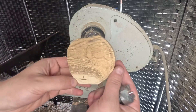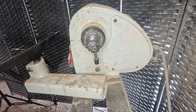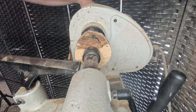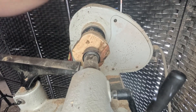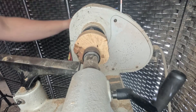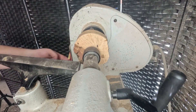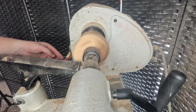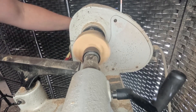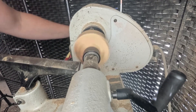Here it is — tiny little blank. Let's connect it in between centers and start turning. Tighten everything up, see how it turns at 800 RPMs. Turns pretty good. I'm going to turn up the speed just a little bit because it's so small — faster the RPMs the better for these small pieces.